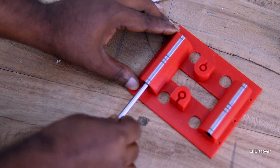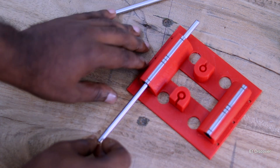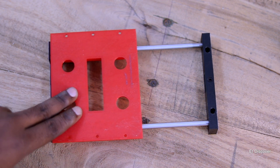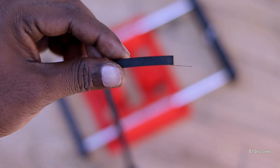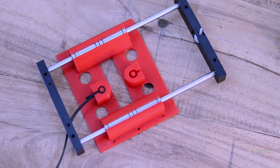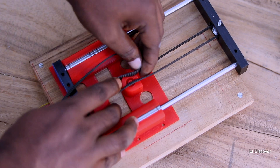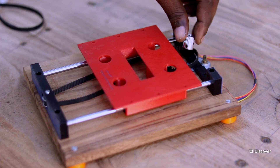My 6mm smooth shaft is sliding very smoothly — like ice cream. I'm going to use a GT2 belt here to push and pull the table of my Y-axis, which is quite accurate for this kind of CNC machine. And now you can see my Y-axis is completely done.